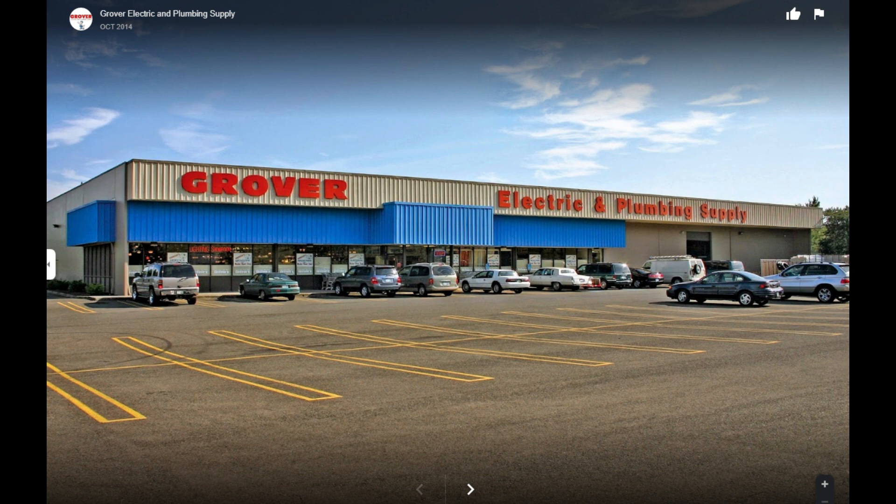You don't split a 240 circuit — you're supposed to have a dedicated plug for every 240 device. You don't carry those items because you don't want to run the risk of having something plugged in and then plugging something else into it and having them both at the same time. Then you've got dangerous stuff going on.